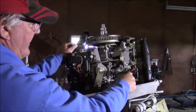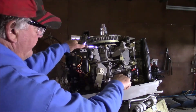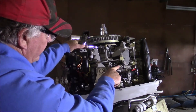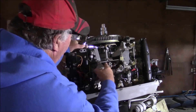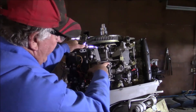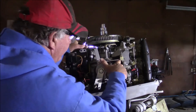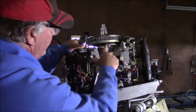You can hear that click - that's it opening up that valve to let a little more fuel into the motor so it would start up a little easier. You have the one ground, and this wire comes up. If you look, it goes through this wire loom clamp, comes back down here, kind of loops back up, and then goes into the harness over here. Then the other part of the harness goes underneath that boss - not over, but goes under. Then goes into this connector right here. There's a wire loom that kind of goes back into this recess, comes back up, into this wire loom right here, and then goes up to the stator plate.